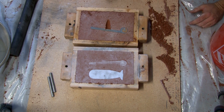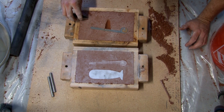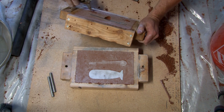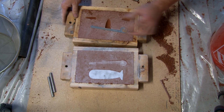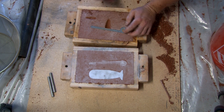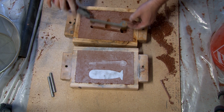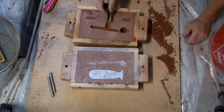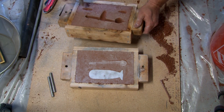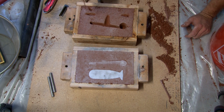When I cut my gates and air vents, I usually do it in the cope — the top half. When my pattern is a half pattern with a flat side, it's a lot easier to grind all that material off because the aluminum is going to fill in the gate and the air holes. That way, it doesn't really matter what the back looks like and it's a lot easier to clean off. I don't have to reshape so much of the casting after it gets done.